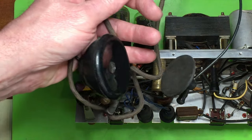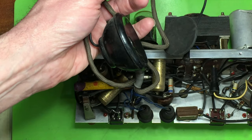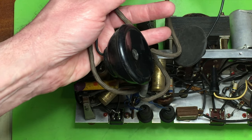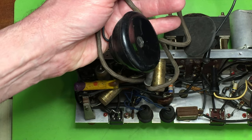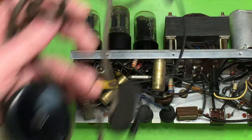So it's probably going to be too low, though it would work with those transformers, one or both of those. It was 600 ohm. That would make it about 12k through a 20-to-1 transformer, which is not good, but it's a lot nearer than anything else I've got. So I'll give that a go as well.